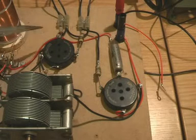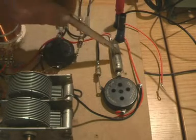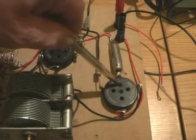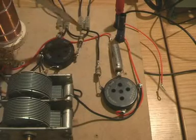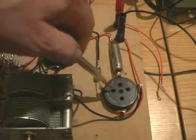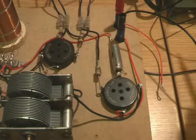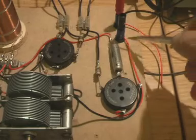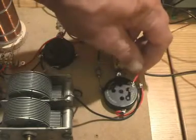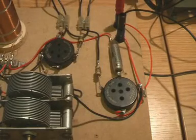I've taken the valves out. This is the resistor which acts as a load in the anode of the triode valve. From the anode of the triode valve is a wire which leads to a capacitor, which will keep the DC, keep the high tension out, but allow the audio frequencies through into the grid of the pentode. This little gizmo here is the same as that one — that's just to reduce the voltage from the computer power supply from 3.3 volts to 2 volts, which is what the filament of both these valves requires. We've got a separate power supply which drives the speaker and returns to this point here, and then goes into the anode of the valve. This loose lead here is the terminal which fastens on to the little pillar terminal on the valve base.